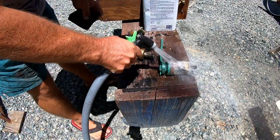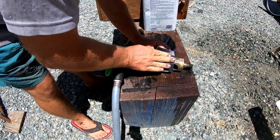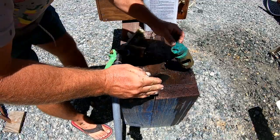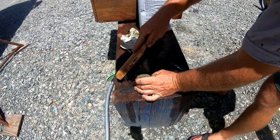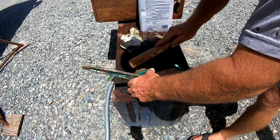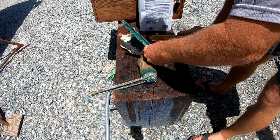After using solvent to get all the grease off, I'm going to give it a light wet sand to get the corrosion off and smooth it a bit. There is some pitting on these tapered plugs, so I'm going to use a wire brush to get the rest of the corrosion off, and then I'm going to slather some epoxy on them and use epoxy to fill the pits.